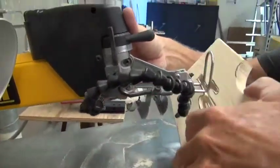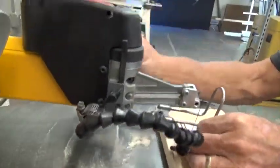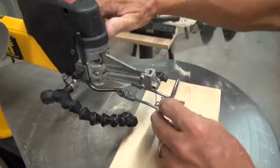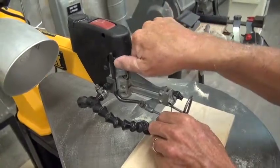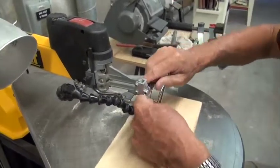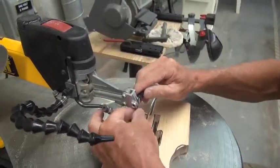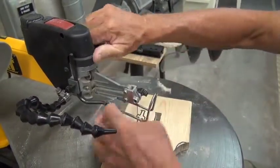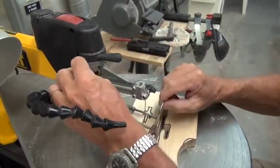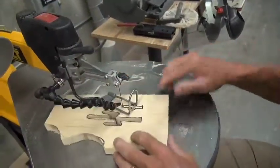So we raise it up, line up the hole, bring it in. Blade in, tension. Okay, I'm not getting a high pitch, so I'm going to loosen that again. Make sure I can try to get, because I've just raised this up, sometimes I want to make sure it's back in the right position. Tighten it. Bring down the shoe. And I'm ready to go.